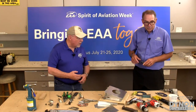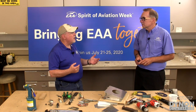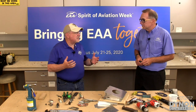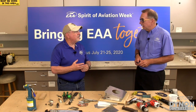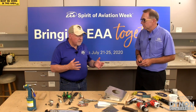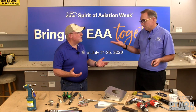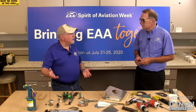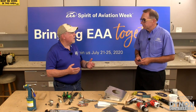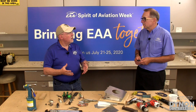The driven rivets are more traditional in that if you go back and look at any factory built airplane, your Cessnas, your Pipers, your Beechcraft, all the old Warbirds, any of that stuff, those were all put together with driven type rivets. That's kind of the legacy way to build aircraft. They didn't develop the pull rivet technology until later on. And there are various different kinds of pull rivets, as you mentioned. There's the hardware store, what they truly call pop rivets, which are aluminum. Typically in the aerospace industry, we're looking at stainless steel or some form of steel rivet or some other alloy of structural strength, designed for that particular application.